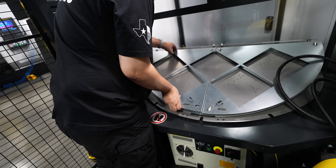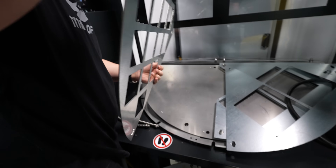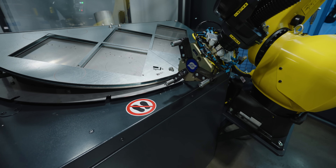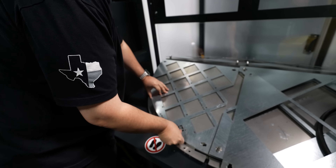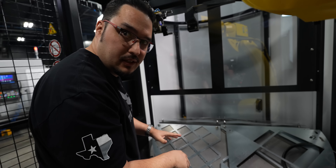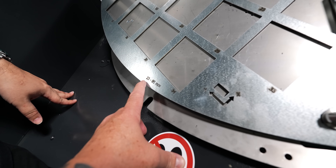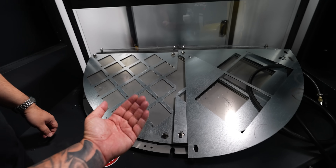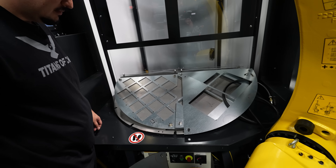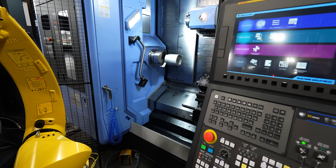Go ahead and show them how quick that comes off. So you take that one out, then you can grab this one — this one actually has 16 openings, so 16 parts on this side, 32 all together. It's a really cool system. The machine has all these saved, so you just select which one you're running. Each one has a number — this one's 23 to 85 millimeter. And you can actually stagger them so it just holds the material perfectly. We'll go ahead and take this out, show you how to program it, and then operate the robot and show you how easy this is for job shops.